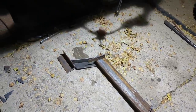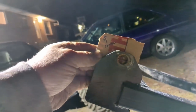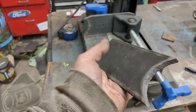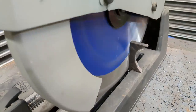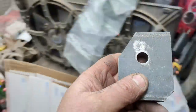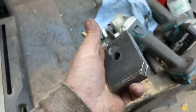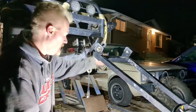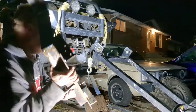I'll just set it right here on the ground out on the cement and weld it all up. It's all welded up, and now I'm just going to make this little bracket — nothing, no big deal. Everything else is at a quarter inch but I do have some three-eighths scrap right here, so we'll see if we can get two brackets out of there. Half inch hole. I tack welded them together so they'd kind of stay, but now I can bust them apart and go throw them on and weld them up. I got these tabs bolted on there — they're going to be on the outside. So now it's just a matter of holding this up and tack welding it into place and welding them up solid.